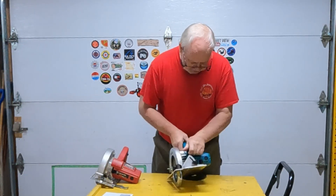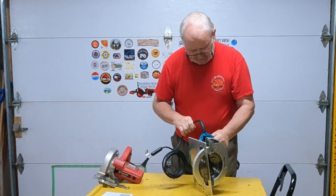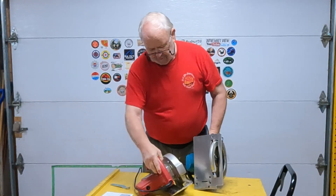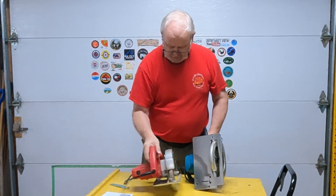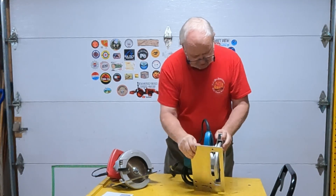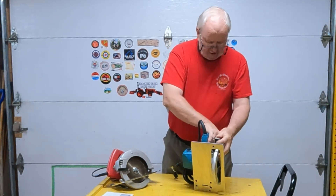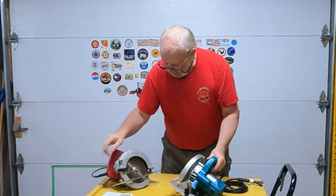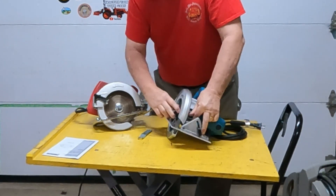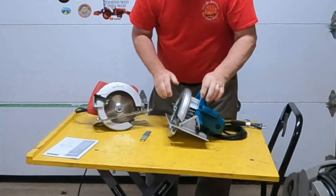There's a dimension scale along here and along the front for adjusting the angle. It's nice and easy to get at out here at the front. But this is the part I was most interested in — in order to check the depth on this old King saw, you saw me wrestling there with that thumb screw, and I had to put that thumb screw in myself. It was worse than that before I started. But this one just has a lever. You pull up on the lever, adjust the shoe wherever you want it, set the lever back, and clench it in place. That's pretty sweet. There's also a lever back here that will lock the arbor so you can change the blade. A little lever right there.